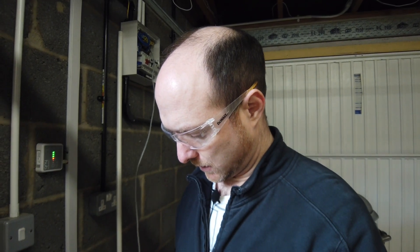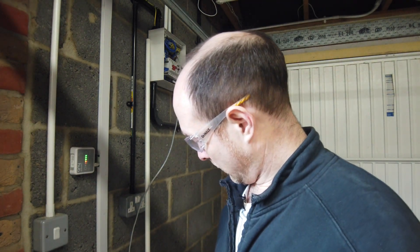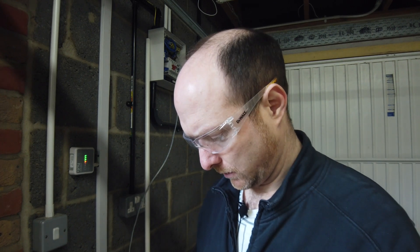Right, so we're at a stage now where we've got our wire all the way back to the fuse board and we've got our two pairs here ready to go. This is the inductive clamp from MyEnergy. What we're going to do is solder this clamp to the wire and then use some heat shrink to make a good job of it. I think it's going to be easier if we leave a lot of slack at this end and then pull the slack back through the Zappi - the Zappi might come off again but I'll spare you that video. Let's get on with this.